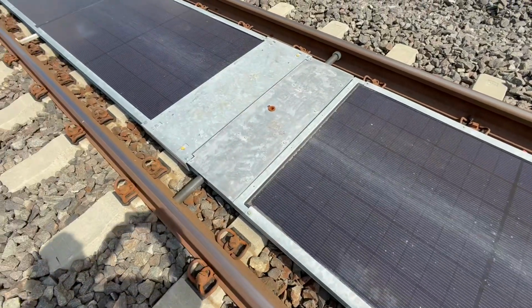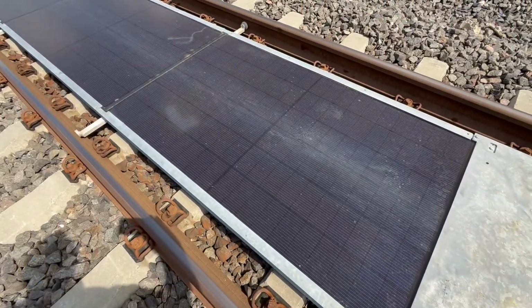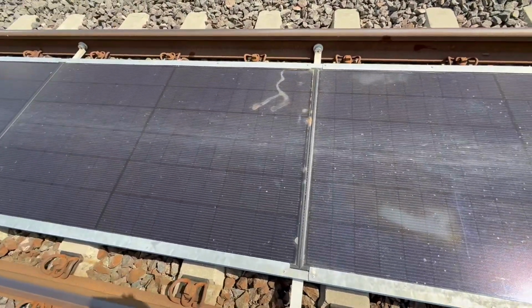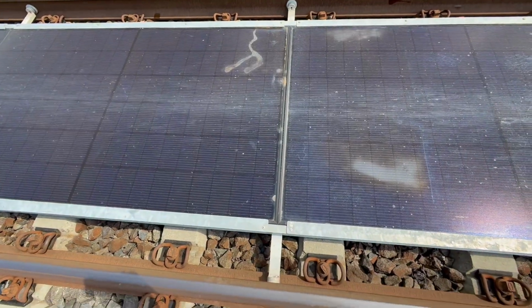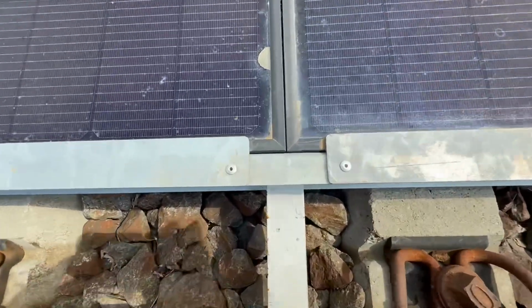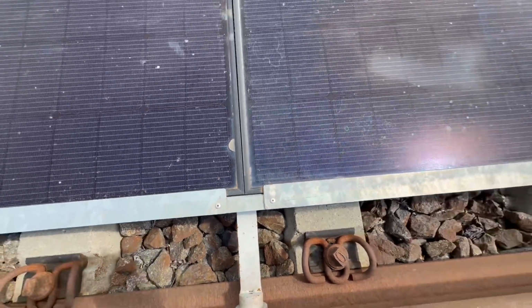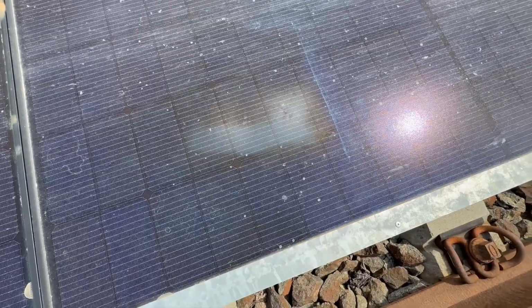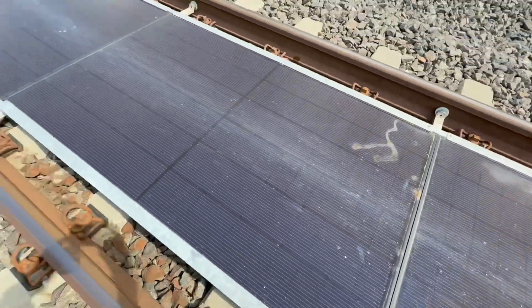And again, you've got a spreader here, which seemed to be correct. Second last of 3 panels. And we got a little bit of a rusty liquid here, a bit of rust that goes in between galvanizing stuff with rivets here. That's just not what I call proper engineering. Again here, the panel appears to have a heat damage spot here. That's probably all in series.